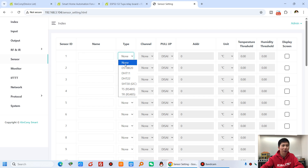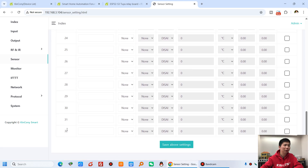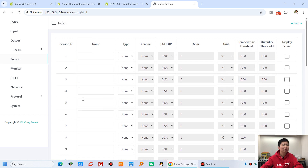You can see one-wire bus, I2C bus, and RS-485 bus — you can choose by yourself. It supports a maximum of 32 sensors per controller, and also supports one GPIO for multiple sensors, such as using the DS18B20 temperature sensor with one GPIO for multi-sensor configurations.